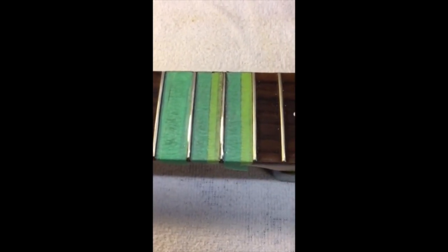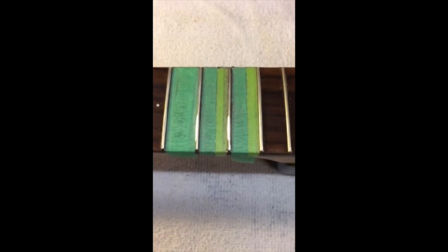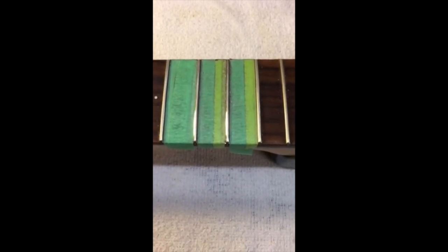I'd follow that with very fine steel wool. Make sure you get the right one; it's 4-0 grit steel wool that you'll need. And as a final stage, you can take it to your buffing wheel and use a little bit of very light compound to polish it out. At that stage, you would remove your tape and go over it with fine rags to polish again.